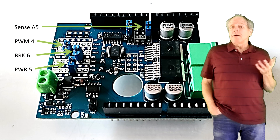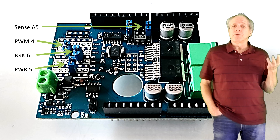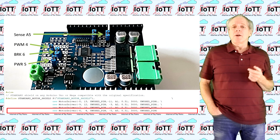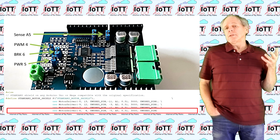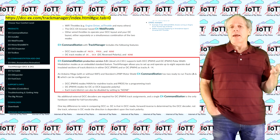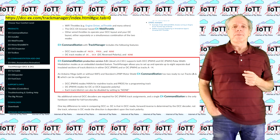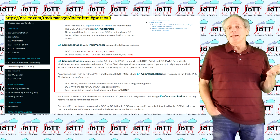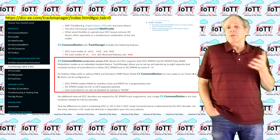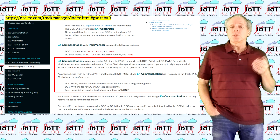The configuration of the power shields is super easy — just add some soldering bridges or jumpers to the pins you want to configure, and make sure you have the corresponding pin settings in the motor driver setup file of DCCX. And if you want, you can add up to eight power shields to the same Arduino stack, each capable to supply five or even eight amps of track power, assuming your power supply can handle that current load. Also keep in mind that you can supply DCC tracks and DC districts from the same command station — for example, two power shields for your DCC tracks and four more for DC districts, as demonstrated in this video.